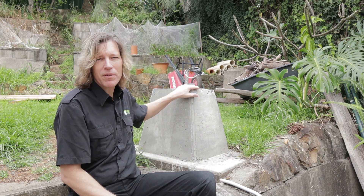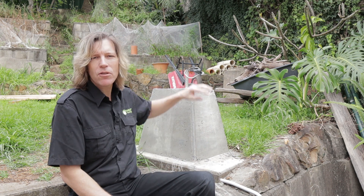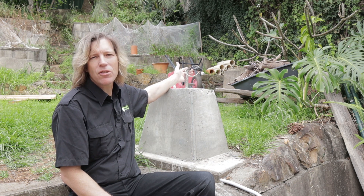This is an extension of a job that I started previously. If you've watched the videos on the deck lighting, this is an extension of that where I had to run some lighting around the deck. I hooked it all up and there was one light fitting still remaining — well, this is that light fitting. We've been brought back to finish it off. They've poured this concrete post and we're going to put a lamp on top. It's a fairly simple process — you're just connecting your active, neutral and earth into a termination strip and basically building the light post and bolting it down.